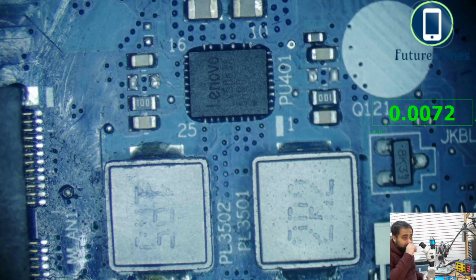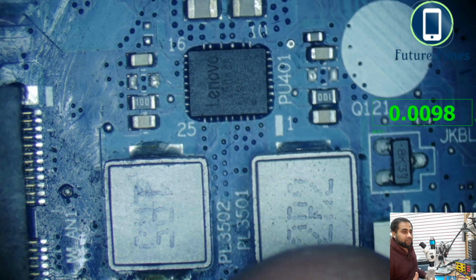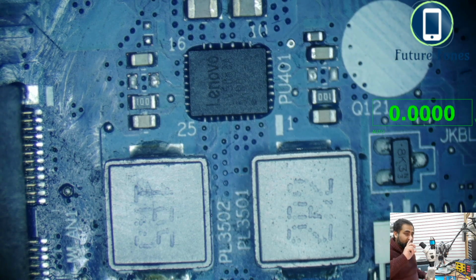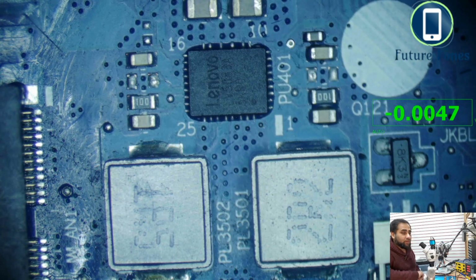Now this could be for many reasons. We will check the leakage, or you can say the less power. This is the reason that if this IC had generated the 3 volt LDO properly, then we would receive 3 volt LDO at the BIOS pin number 8. The battery pins and Super IO pins should have that 3 volt LDO. The power switch is also using the 3 volt LDO. So if this LDO power is not generated, then your laptop won't power on.